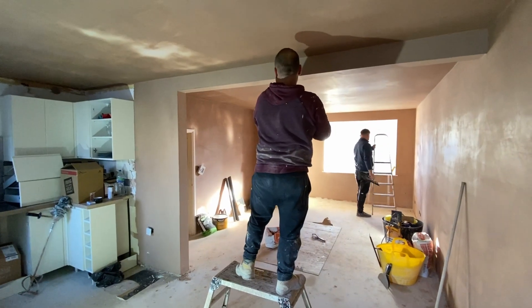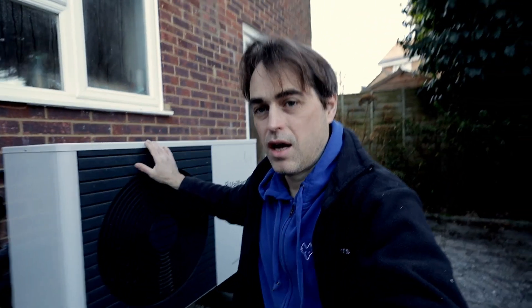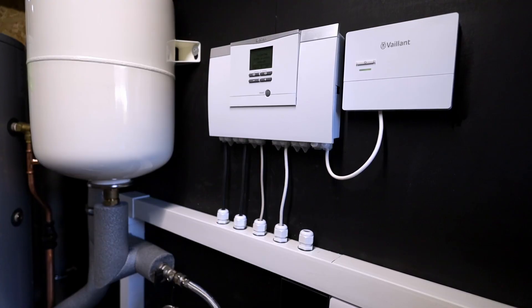While the plasterers were doing the work, me and Marie finished all the wiring of the heat pump inside the garage. Now we're going to fire the heat pump for the ground floor underfloor heating only, and then go upstairs to remove the vented cylinder, header tank, and cold water storage tank in the loft. What a day to be commissioning - it's minus five this morning and probably around zero all day, so I'm hoping we can actually fire it in that temperature.